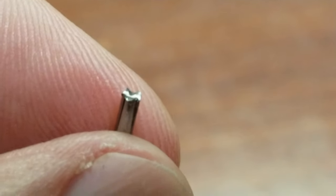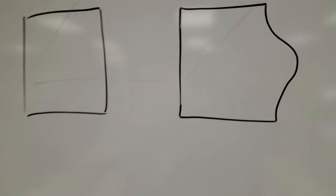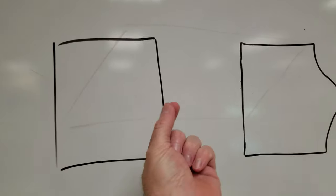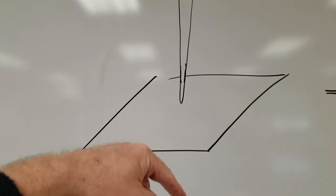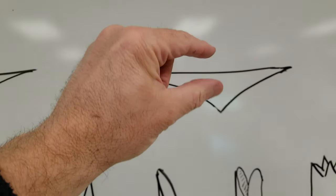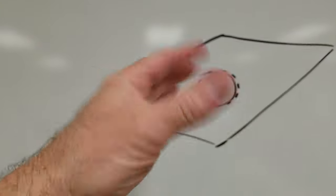This is a shot of the goal — what you want this nail to look like. We want four separate heads, those little points, and that'll punch a hole out as opposed to trying to stretch a hole. We're going to go over making the needle that we need to punch a hole in the sheet of plastic. If you grab a sheet of plastic and pull it, you'll stretch it and then when you let go it'll come back a little bit, but you've actually made more material because you've stretched and thinned it.